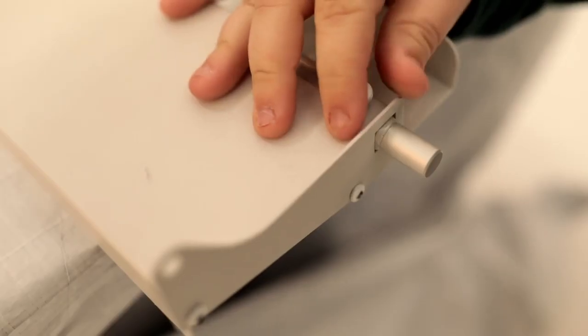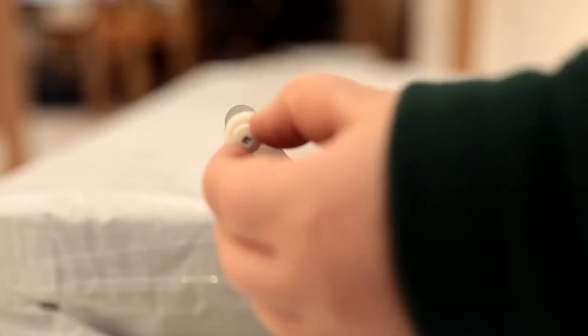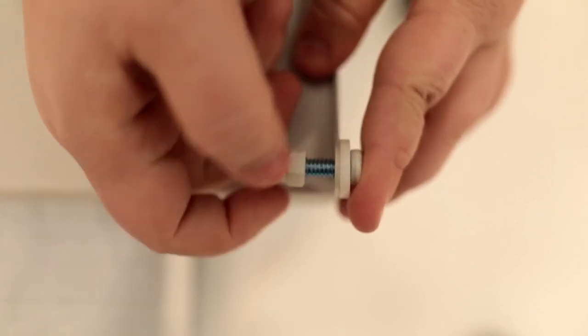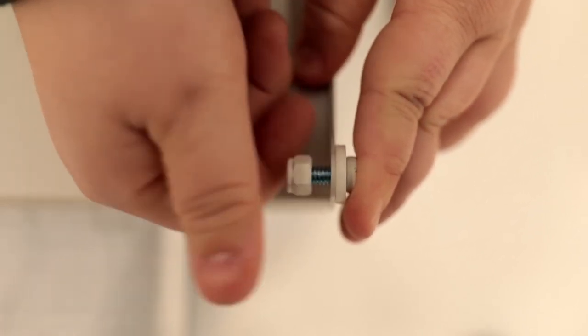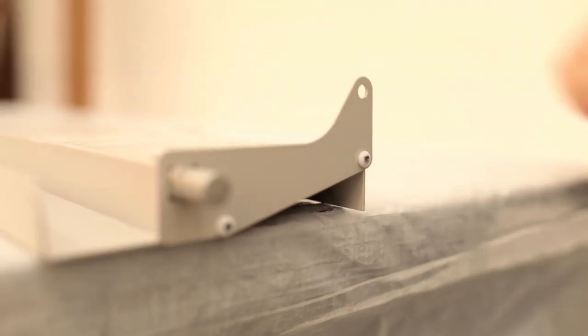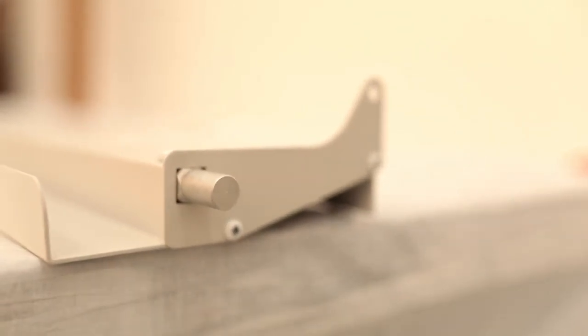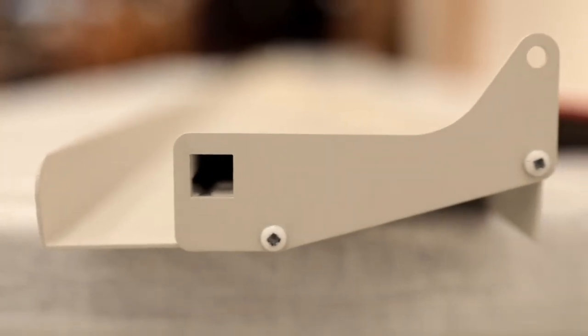On the end of the louver with the bolt slot, ensure the pin can move easily after the louver end plate is installed. Finally, from the outside of each louver end plate, loosely install a pan bolt with nylon washer and lock nut. This hardware is needed in a later step. At the end of this step, you should have 36 louvers with the standard pins attached and 6 louvers without standard pins.